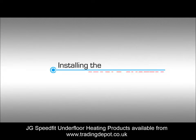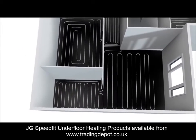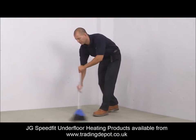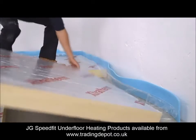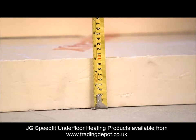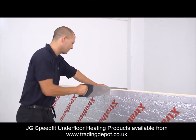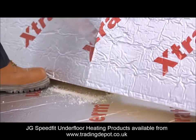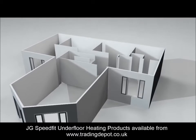Installing the Staple system. This system is suitable for large installations and lends itself to irregular shaped rooms. First off, the insulation for the UFH should be fitted to a flat surface. This is important as the sheet insulation must be fully supported for maximum strength. Insulation depth and quality should be as required by design or building regulations, whichever is greater. Confirm with your building inspector that the insulation used is correct before proceeding with the installation of UFH. External walls should also be insulated to building standards to prevent heat loss.